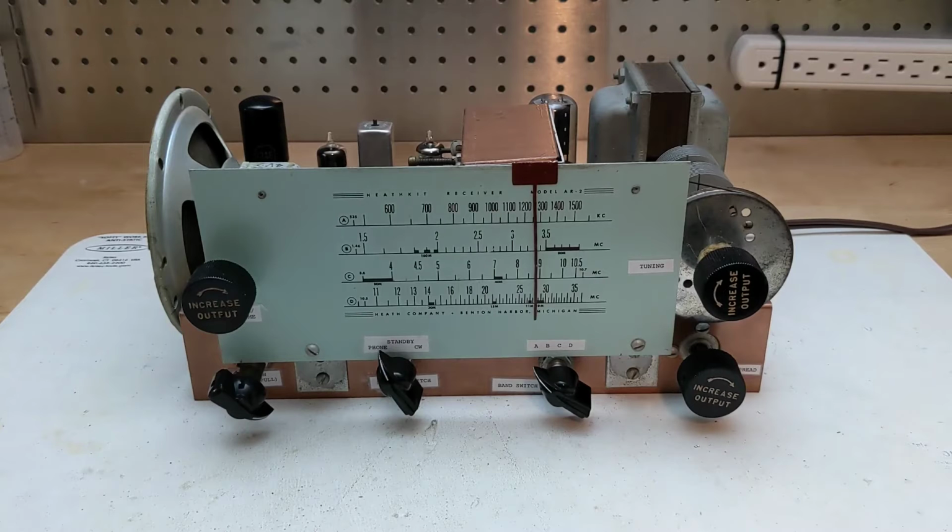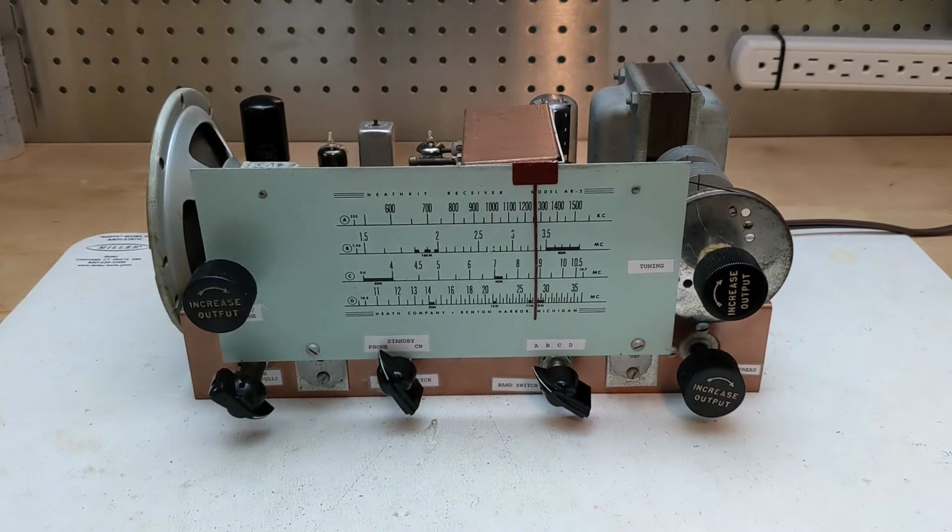In this video, we'll take a look at the Heathkit AR-2 communications receiver. The AR-2 was a shortwave or communications radio receiver offered in kit form. The basic features were the following: a general coverage receiver covering 535 kHz to 35 MHz in four bands,